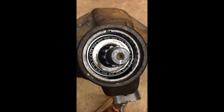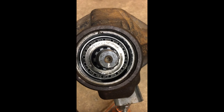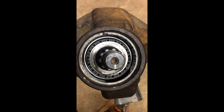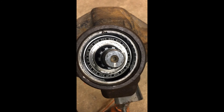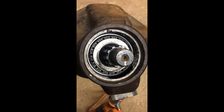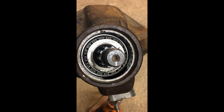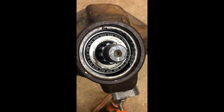I've cleaned the bearing that pops out, cleaned it down with petrol and put it back in. The condition appears to be OK — the bearing and the bearing race are well worn, but it doesn't appear to have actually gone through the case hardening, which I'm pleased about because I really don't want to have to fit new bearings into this.